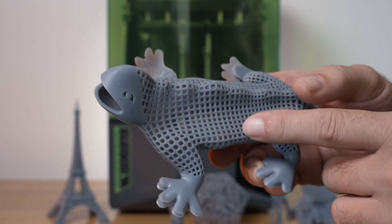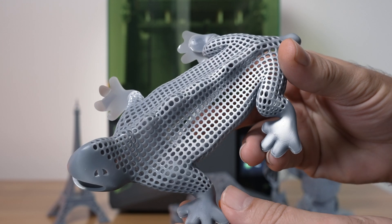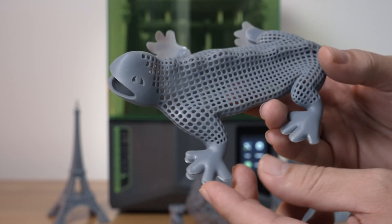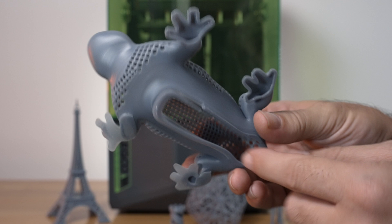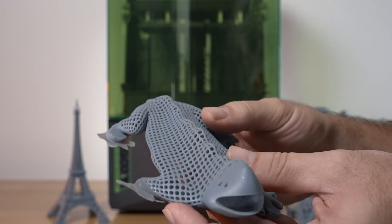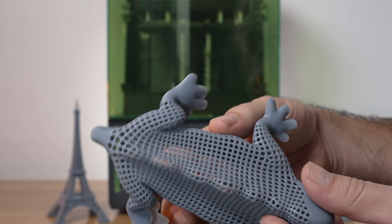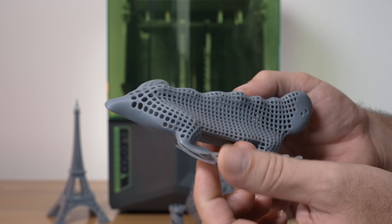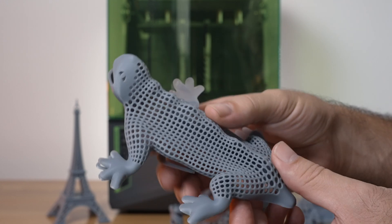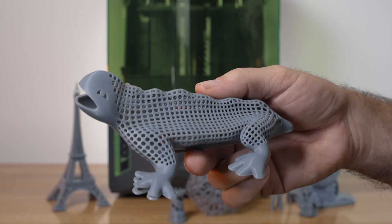Here we have this droid lizard thing, which is really cool because it has all these holes. Looking at the top it looks pretty much perfect, and even on the smoother parts it's beautiful. I did do an experiment with a very low exposure time and a few layers on the bottom, and they ended up delaminating. That was kind of my fault — I was experimenting to see how low I could go, and this was 10 seconds on the first three layers, which was too minimal and it didn't want to stick. I ended up going to around 25 seconds on the first five layers, which is about right.